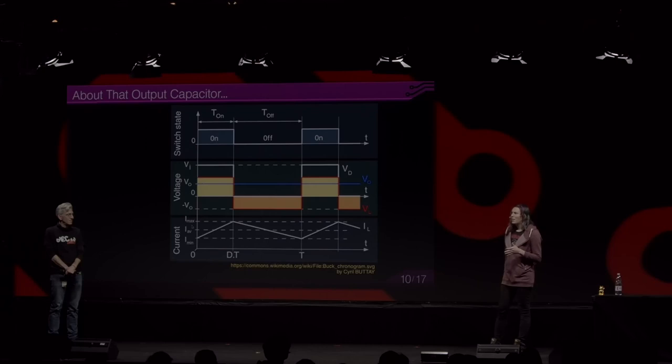I made a design which had microvolt noise because I found a capacitor with its resonance frequency exactly at the switching frequency. So basically, all that noise that was coming from the switching action was reflected away at higher frequency ranges where it got filtered, dissipated much faster.